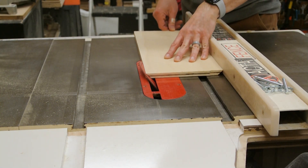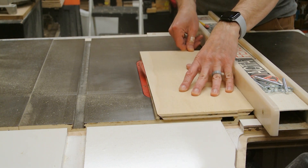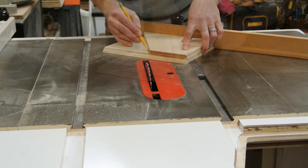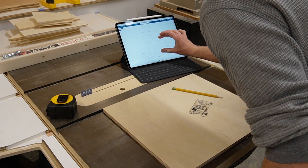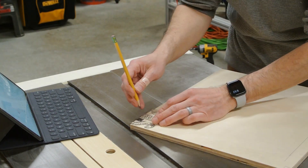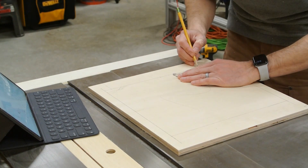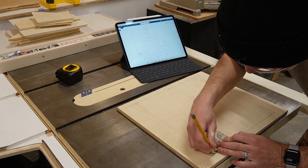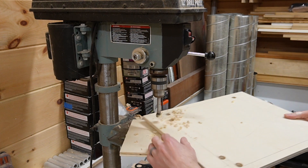I move my rip fence to the left side of the blade so the material is above the cut and the beveled edge from the first cut rides nicely along the fence when I make the second cut. Here I'm cutting the two side slopes that funnel the dust into the duct. Zooming in on my drawing I can see all of the critical dimensions for the upper flange. I used the handy pocket tool that we designed and made last week to lay out the offsets and the stepped details.